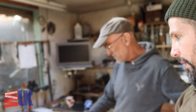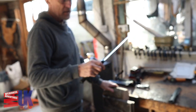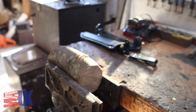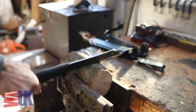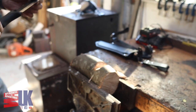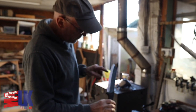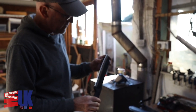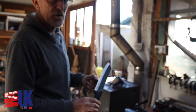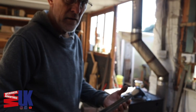We're going to chop into a piece of English beech which is almost seasoned — it's pretty hard, and you're unlikely to encounter much harder than that in any British woodland. Most of your wood in the field is going to be green. So we'll see what 58 HRC versus 52 HRC is like on this particular steel. After chopping with the 240, that edge hasn't been affected — there's no rolling on it. It has blunted it where the bulk of the work was done, but conversely there's no edge chipping. So it just needs a touch up.